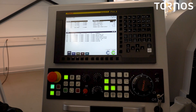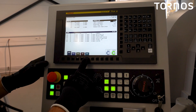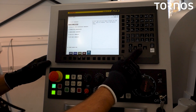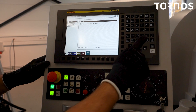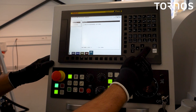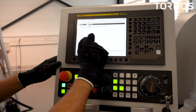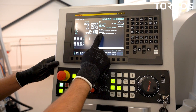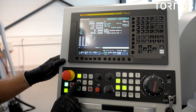In the TORNOS page, you will find ADV. Press on it. Then select Collet and Guide Bush Manager. Input. In Collet, move with the right arrow to the Collet and Guide Bush setting. Activate this function with Alt. Now you have a message — confirm that the function is activated. Now you can open the door.